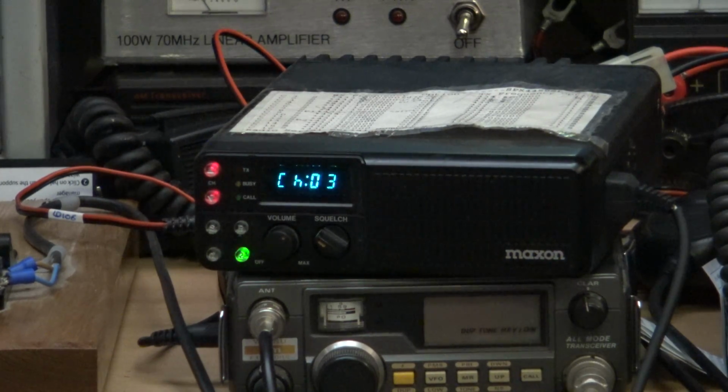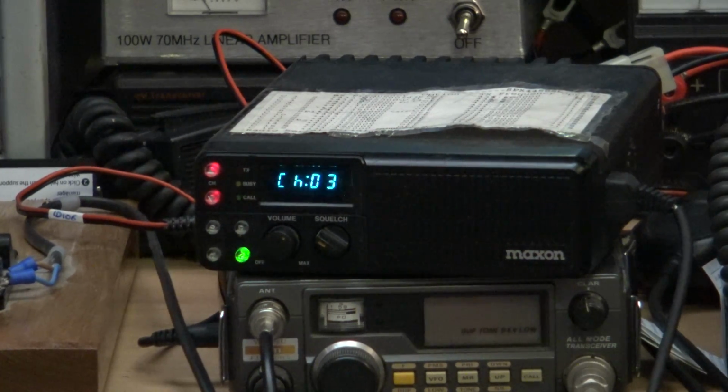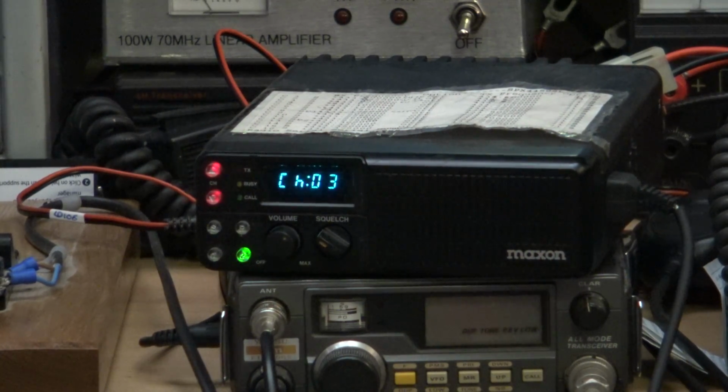So Mr. Chippy is on a quarter wave aerial, so it's just a 5.5 inch aerial, and like we did the PMR 446 half watt sets, it's only the same length of aerial, but it's a properly fitted aerial into the body of the car in the centre of the roof, and it's with industrial grade 6mm cable. So it looks like RG58, but it's a much better grade, and it's suitable for 1 gig upwards.